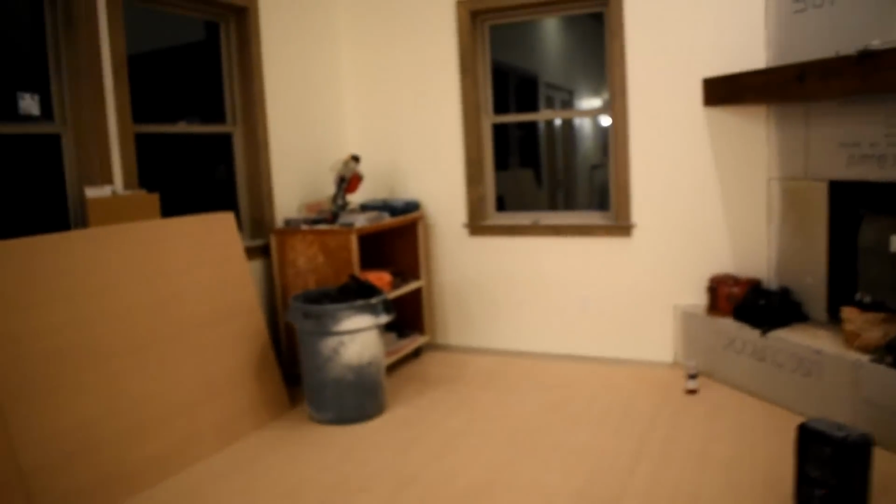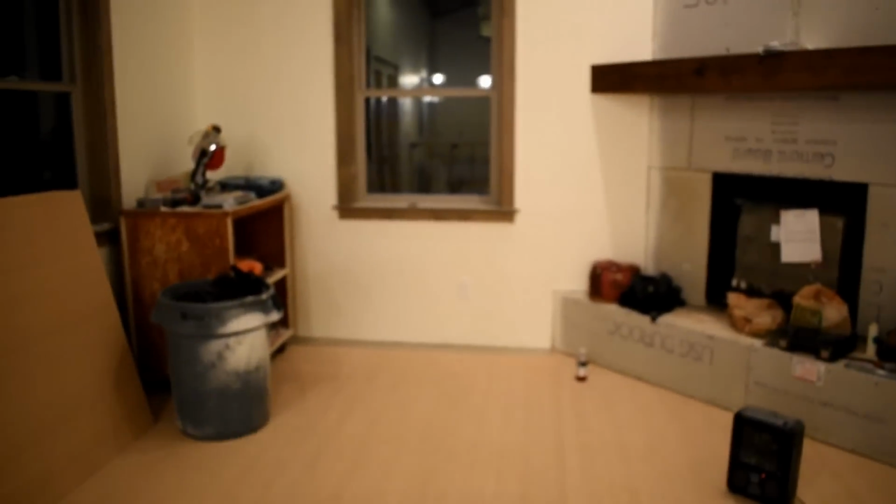End of day two. I have not got anything done to the upstairs bathroom yet, or the little sink area up there, or on the steps as far as installing underlayment, just this downstairs floor area. I've got everything done down in this area. Tomorrow, like I said, I will sand over these joints in the underlayment and mud them, and we're going to start installing LVP tomorrow.